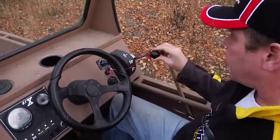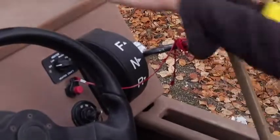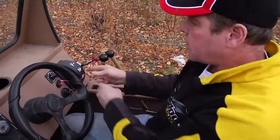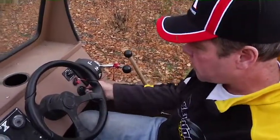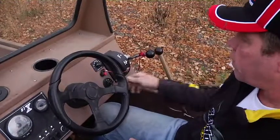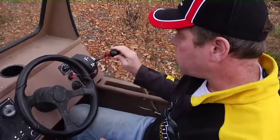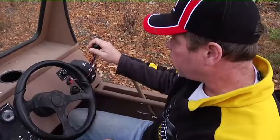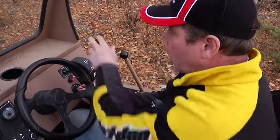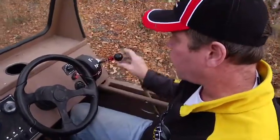The remote control is a single lever remote control with neutral, forward, and reverse. We prefer this over the dual lever because it's so much easier to make an emergency maneuver. The boat will not start unless it's in neutral — if it's out just a little bit, the horn comes on but nothing happens. You have to be in the little detent area for the boat to start. If you're floating down a river and need to start quickly, you can hold the key over and move the control down until you hear it start.